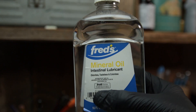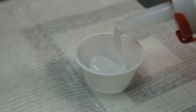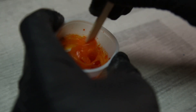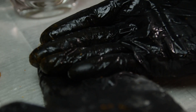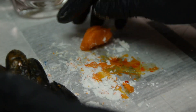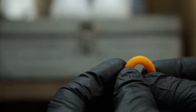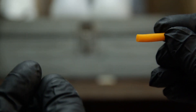Here's another little trick — mineral oil. Extrude some silicone; this time I'm going to go with a different color. Let's mix this up looking like an orange. Lay it out on the corn flour, and I've put mineral oil all over my hands. Look at the difference that it makes using mineral oil — the consistency reminds me of a taffy. And this is what it looks like when it's cured: very flexible, very strong, and stretchy.